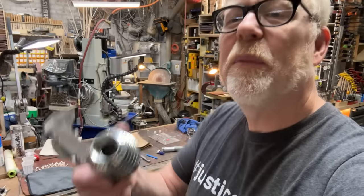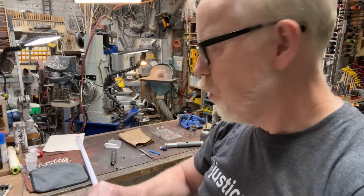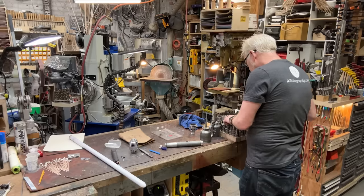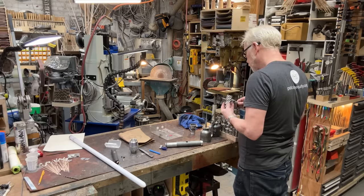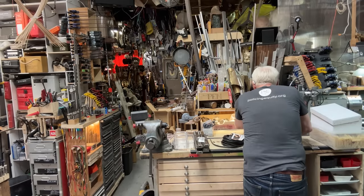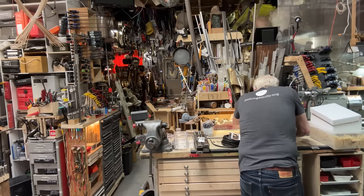All right, I'm going to take a plate and drill a hole through it that's exactly this size, which is 1.4, give or take. Let's pull out my annular cutters. All right, that'll do it. Excellent. This is 1.43 and I need 1.405, 20 thou plenty for me to be able to grab it. But what I need is a chunky chunk. Hey, that's exactly what I need.